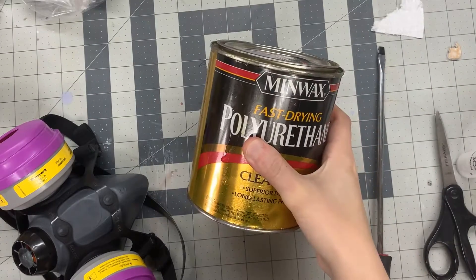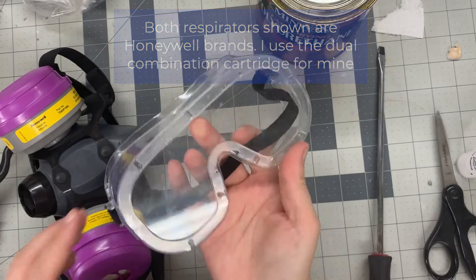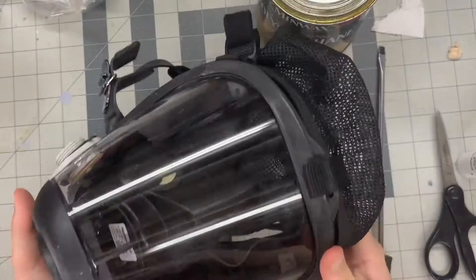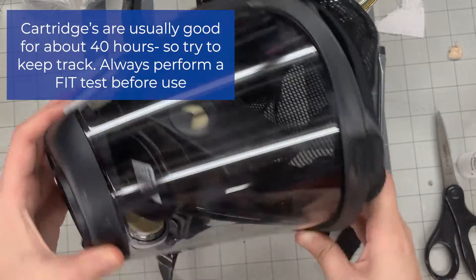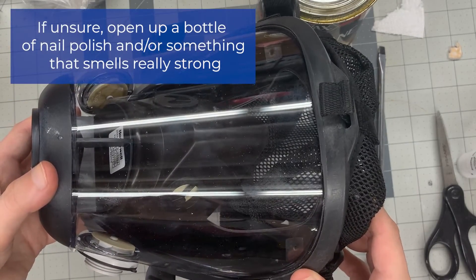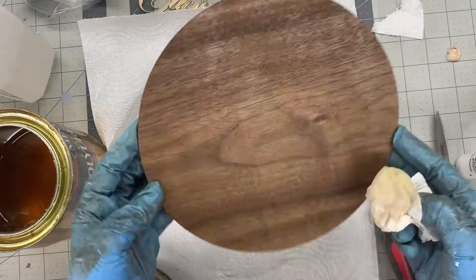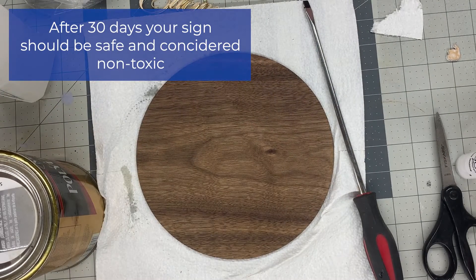Stain is optional. If you do want to use stain, we suggest using either a half mask respirator with non-vented goggles — you can tell if it's non-vented by making sure there are no holes or slits on the side. Your other option is using a full face respirator. This is where the cartridges would go, and you want to make sure you have the correct cartridges for whatever respirator you choose. You also want to make sure you have the correct nitrile gloves on and don't get any stain on you. Make sure you're working in a well ventilated area and allow enough time for the project to off-gas for at least 30 days.